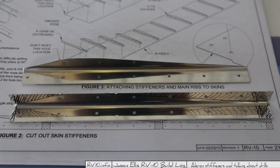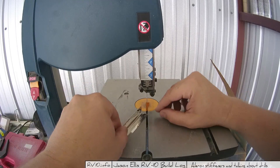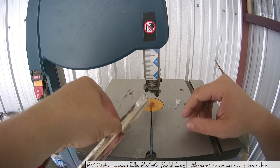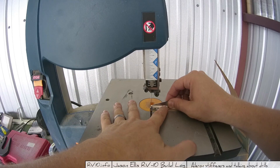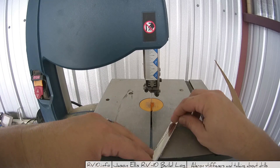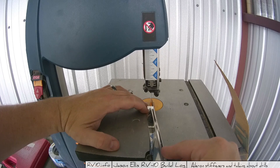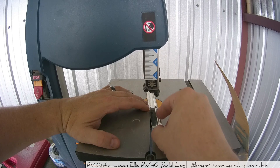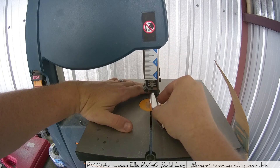Here you can see an image of exactly what I'm talking about. The upper rib is basically done; the lower one is marked and ready to be cut. Due to the reflectivity of the metal, it looks marked all up, but it's actually only marked on the side without the holes — it looks like both have holes because, well, mirrors. Here I'm trying to give you a better view of how I go about doing this — this was really awkward, by the way, to have the camera between my head and the cutting surface. You will need a good bandsaw. I'm going from notch to notch, going past the notch and cutting off all the excess after the notch because it's supposed to be smooth and even. Mark up all your parts and stay within the lines — see, I went past the notch there and it works nicely.